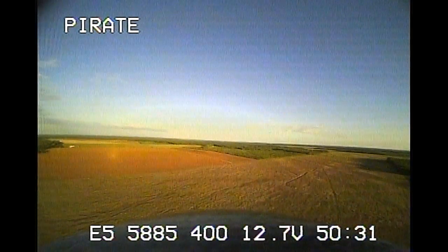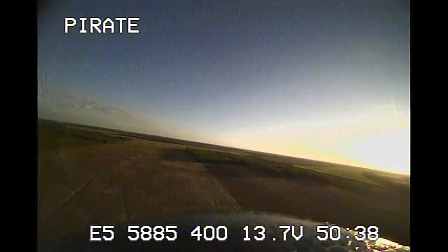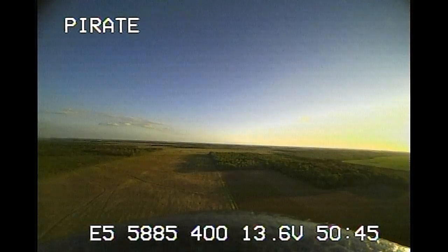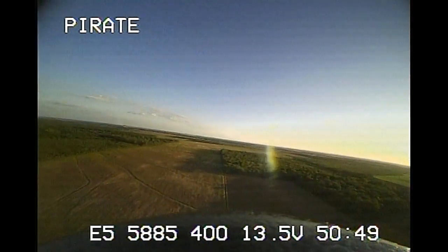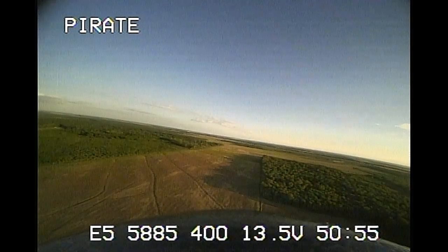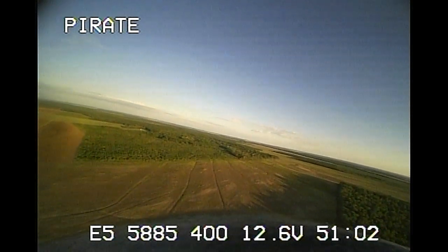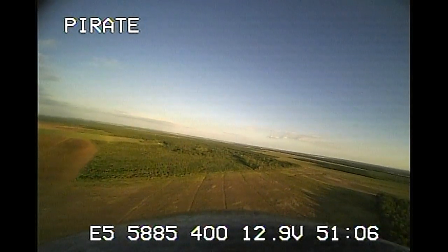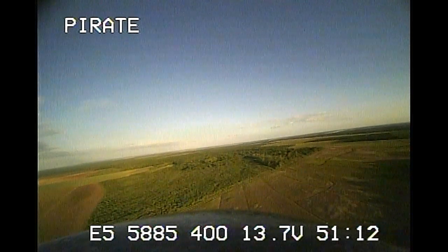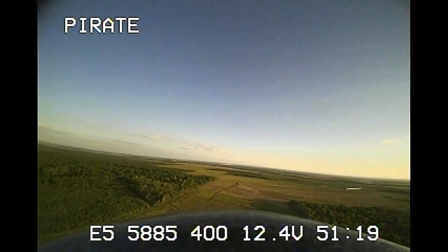I'm not comfortable doing that a lot because I have run into an issue before with an old open LRS receiver that would not rebind all the time — it was about a 50-50 shot on whether it would rebind when you turned the transmitter off and back on. I was unlucky enough to discover that actually in flight when I tested my failsafe return to launch, and it wouldn't rebind. I cycled power on my transmitter a few times and it actually rebound. I later found it was kind of a firmware bug that was fixed, but it's still not something I enjoy doing if I don't need to.